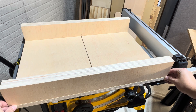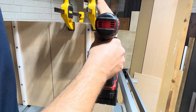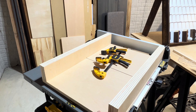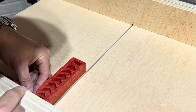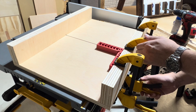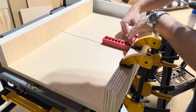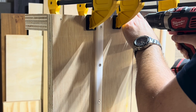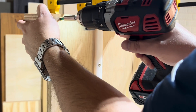Unlike the rear fence, do not add glue to secure the front fence in case adjustments are needed down the road. Position the fence with the edge of the base and clamp down one side, then pre-drill and screw in one two inch screw on the end. Remove the clamps and pivot the front fence to square it up for a super accurate cut. I used a 90 degree positioning square and took my time to align the fence, rotating the square to ensure both sides are aligned. Clamp down the fence and double check it's still square before pre-drilling and driving in two inch screws on the end and to the left and right of the blade location. Ensure the screws are below the surface of the base.